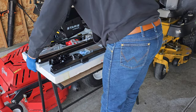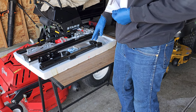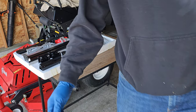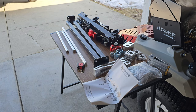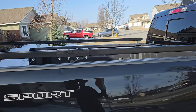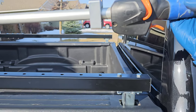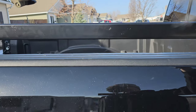First thing we'll do is mount our trimmer attachment. I've got to read the instructions because I've never done one of these Equipment Defender brand — I've done the GreenTouch industry one, but not Equipment Defender. The instructions say I have to mount these two pieces first — they go directly on the rails. However, they don't tell you exactly where to put them. If you mount it all the way to the back, your trimmer is going to be sticking way out and you won't even be able to open the door.